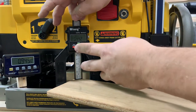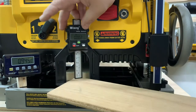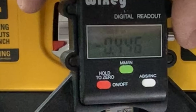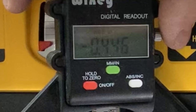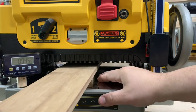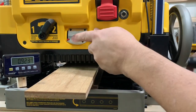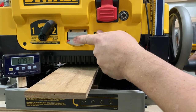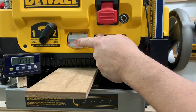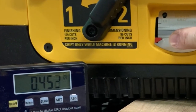I'm going to measure this piece of wood with a depth gauge, set it at zero, then push it down to the table and see that it's 0.446 — roughly half an inch. I'll put that piece in over the top of the MDF that we set the zero to on the planer, and go down until I see it move again to see how close it is to what I expected from that piece of wood — it's about 450.